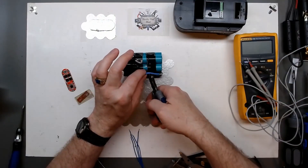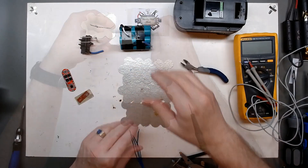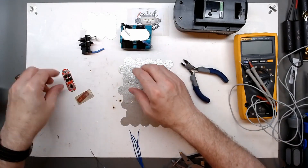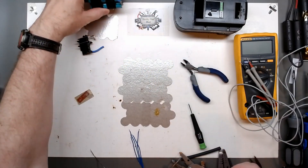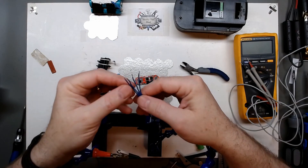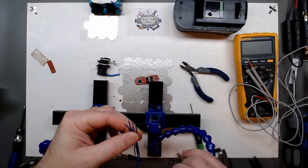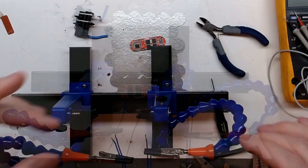I'm going to cut here and separate the pack for now. I've also cut a little piece of mica board that I'll put under this board before we're done, but I'm just going to set that aside for now. I already have some cell monitoring wires that I've cut to length and I'm simply going to go ahead and solder the ends of these wires - just get them pre-tinned - and we'll be right back.